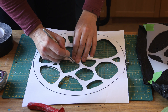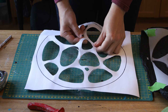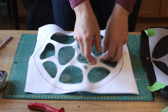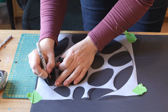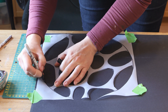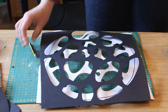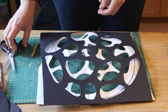I flipped the pieces over, cut the extra bits of tape with the exacto blade, and now it gets interesting — I can actually shape and sculpt my piece of paper, which gives me a much better sense of what it's going to look like in metal. I went back to my other template, applied it on a piece of card — I had black, but any contrasting colour works. I removed the template, cut it out, and positioned both templates on top of each other to start seeing what it's going to look like.